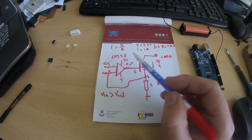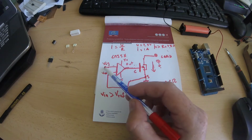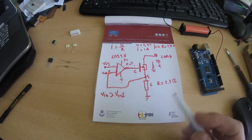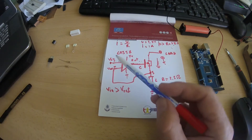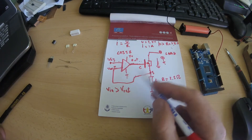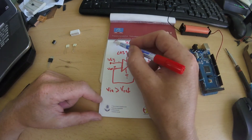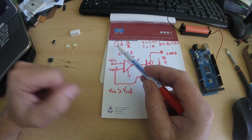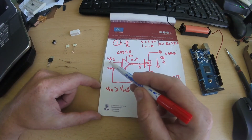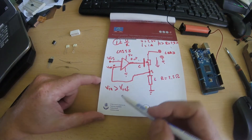How do you provide that reference voltage to the LM358? You can use a variable resistor to set it at 2.5 volts or whatever you want. But in my case, I want to control V-in digitally so I can change the discharge current. I want to be able to discharge at half an amp or one amp without changing the physical resistor.